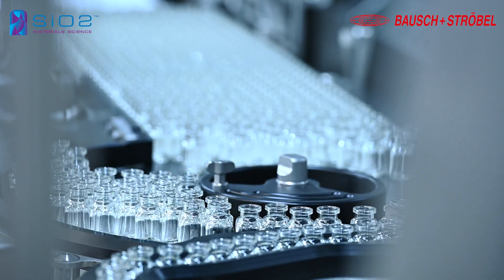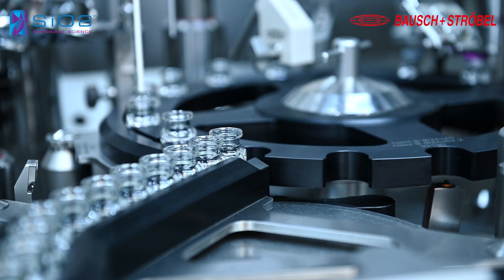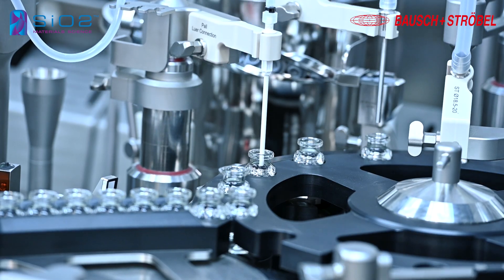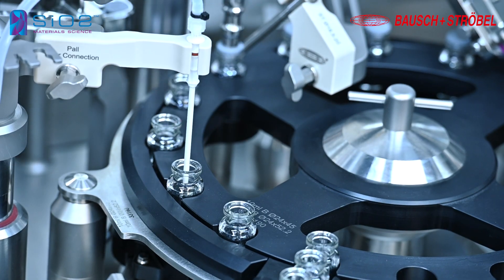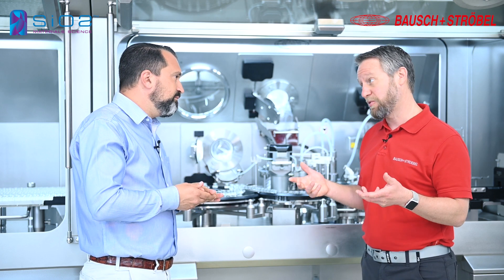Individual processing means we go from a bulk on the rotary turntable into a single lane in-feed, where we then process each container individually. There is one filling needle and one weight scale per container, so we actually do weight dosing. We do a loss-free startup, filling with top-up possibilities, and everything is an inter-related scale filling system because we have feedback.